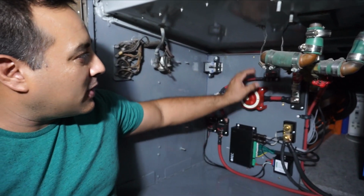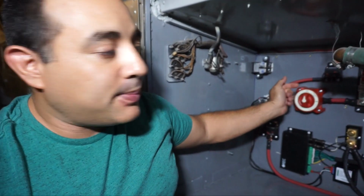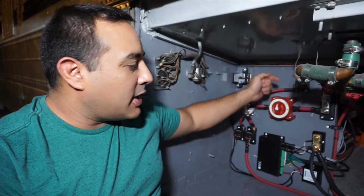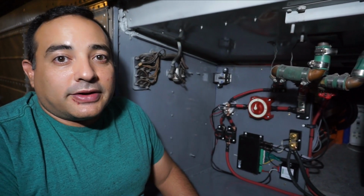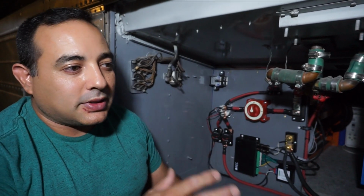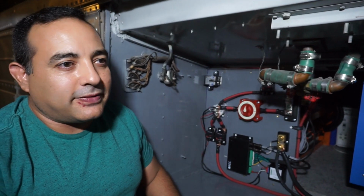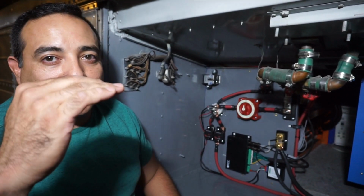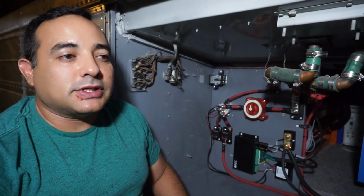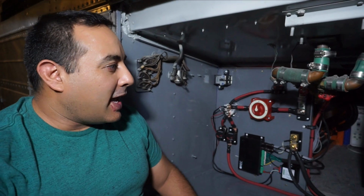Just the mains so far. And then we're waiting on the breaker for the solar input. The reason it wasn't readily available is that it's not 48 volts. Solar coming in is just over 150 volts. So we had to get a special kind of breaker that handles the higher voltage, like 250 volts or something. What we read was that it can be rated for a higher voltage, but it can't be rated for a lower voltage. So if something says it's a maximum of 12 volts, you can't go throwing 48 volts through it. So anyway, that's what we had read.